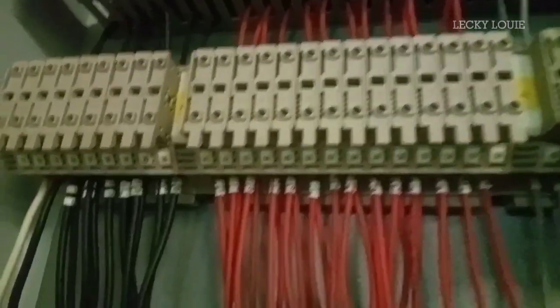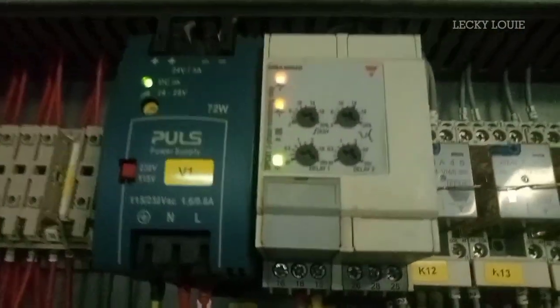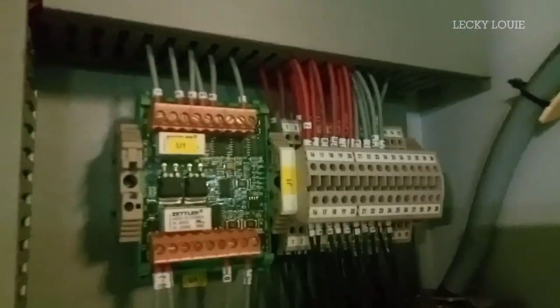Kaleki, before we proceed, I will first show you inside the main control panel of the steering gear. We have a set of fuses, control transformer, phase failure relay, control relays, contactors and overload relay for motor protection, terminal blocks, interface card for alarm unit, current transformer for ampere monitoring, contactor for control voltage, lamp indicator and knob switch, and the main supply breaker.